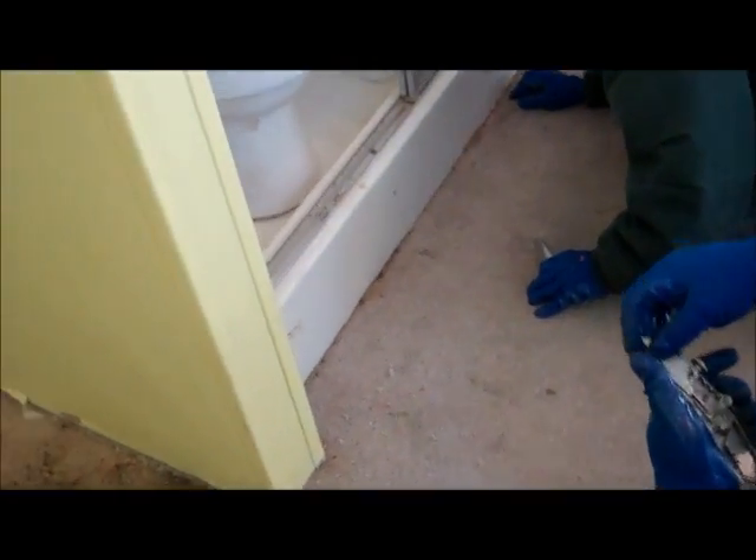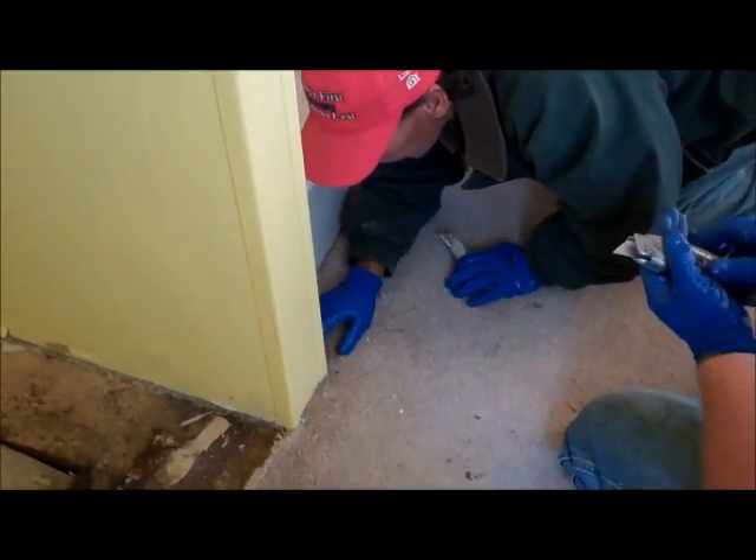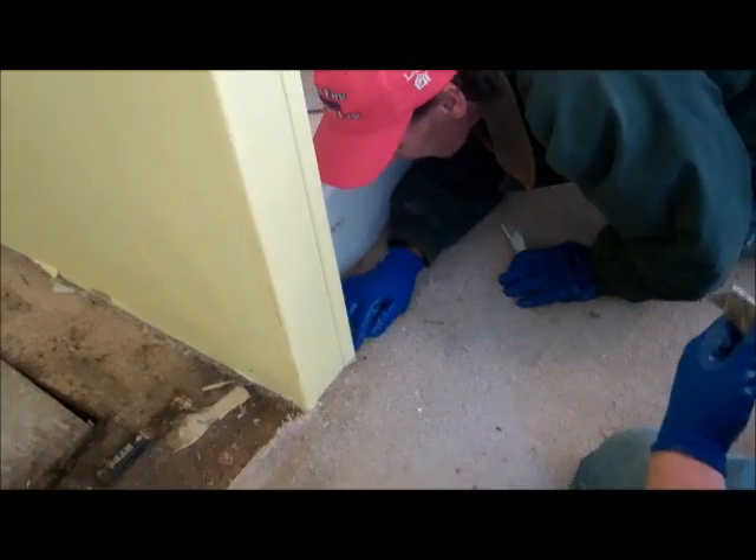It's going to come out here past the linoleum to a solid rafter, and then across the front of that tub right there. We're going to cut in front of that tub — make sure the carpet's not under it, so that's where you want to take your time. Once we get that cut back, we'll peel the carpet back as far as we can, repair the floor, and put it all back together.